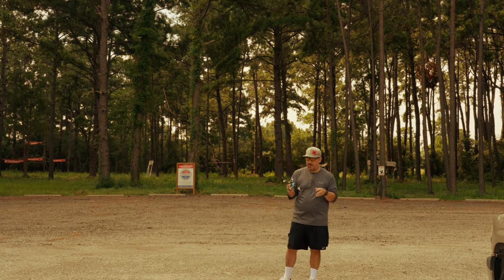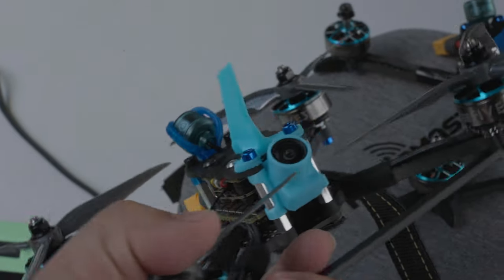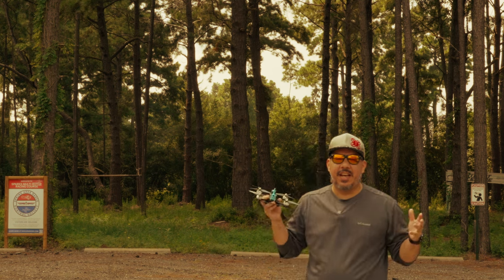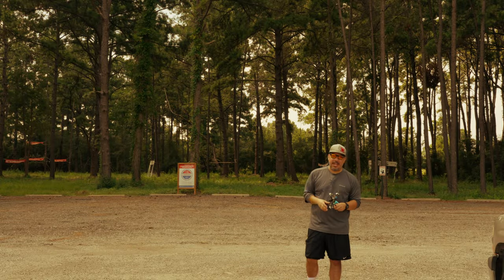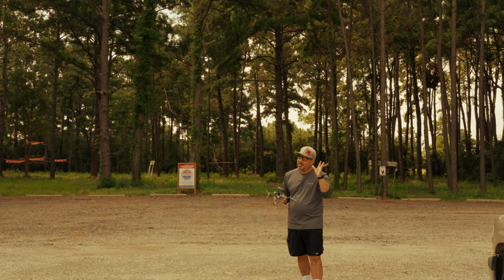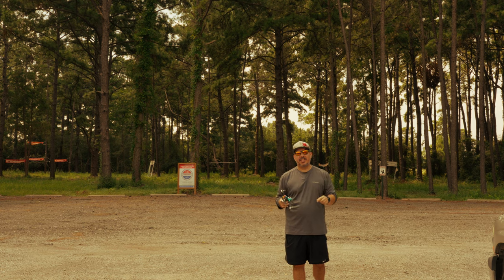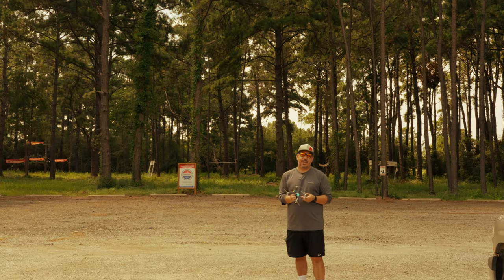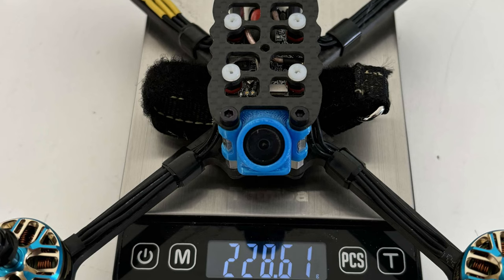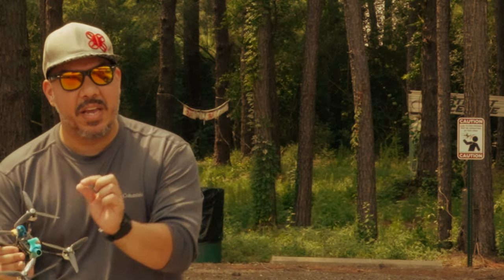Because of the weird mounting on the TBS stack, a lot of my time was just figuring out the best way to mount it. I had gummies hanging it from the top plate and it fit fine, but I didn't have enough room for nuts on both sides based on the screw hardware I had, and it was jittering around. Ivan and Jordi both looked at my black box log and noted it was a little sketchy — and instead of fixing it, I sent it anyway. Half the time building a new setup goes into figuring out your stack layout and the right gummy heights.